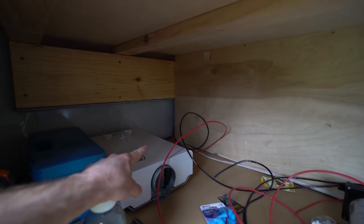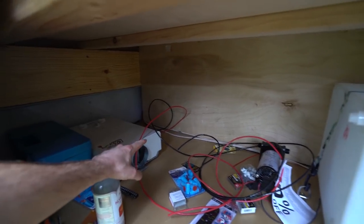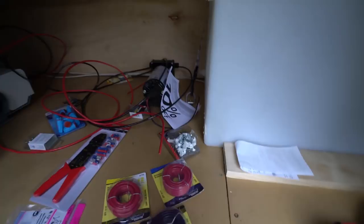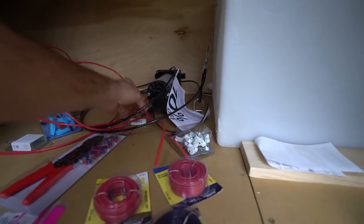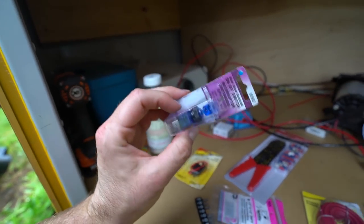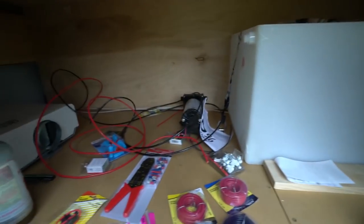All right, here's where we are. I pulled the positive and negative red and black wires, 8-gauge, all the way up into the battery area. I will be connecting those to the battery. Next up, just gonna secure the Romex, this white wire over there, with some of these, and then we are going to play around with the positive end of this pump here and this little fuse, and also this little switch which lights up when it's on. Thought it was kind of cool, a cool way to see if the switch was on or off. So let's get to work.